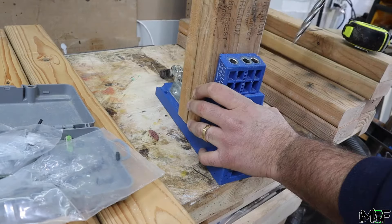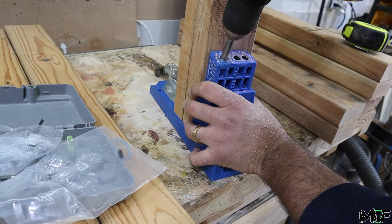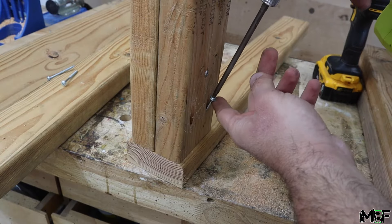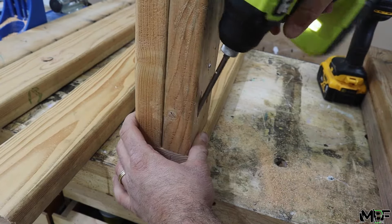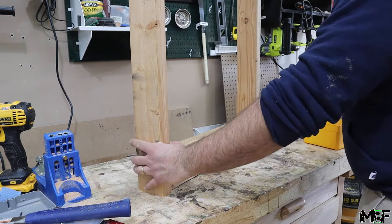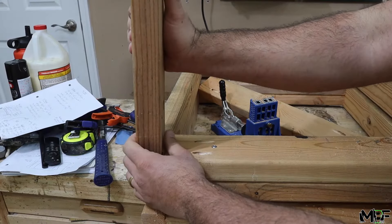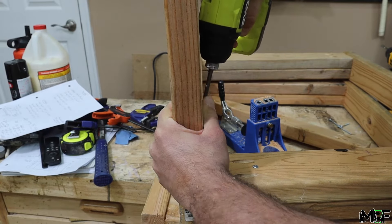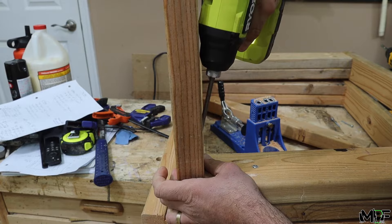For now I'm going to use some pocket screws for my joinery, and because this frame needs to be strong to prevent any failure, I'm attaching them both to the sides of the sandwich 2x4s. I'm also going to come back later and attach metal corner brackets because I want to make sure that I over-engineer the joinery rather than risk this table crashing down from some type of failed joint. Once I've built a square frame from each side of the table, I'm now going to attach longer 2x4 pieces to connect these sides together — this will make for the longer dimension of my flip table. These joints where the single 2x4s meet the double pieces is exactly where the metal brackets will go later on to help reinforce the structure.